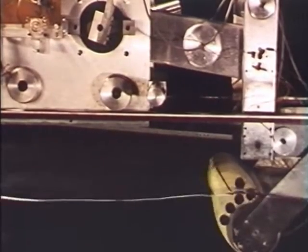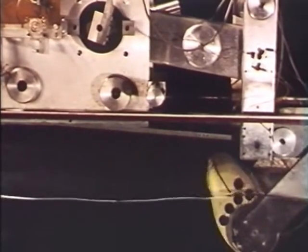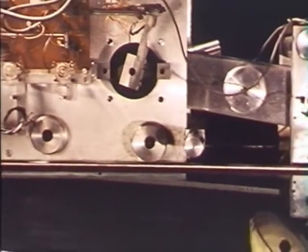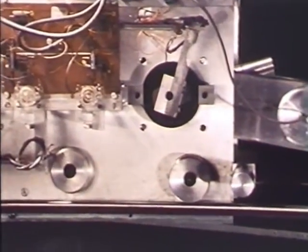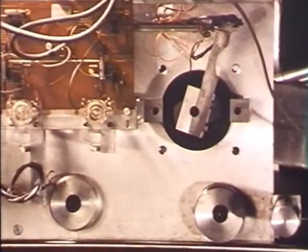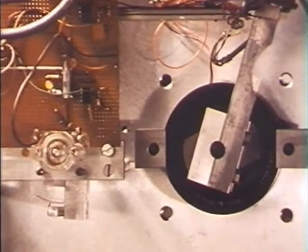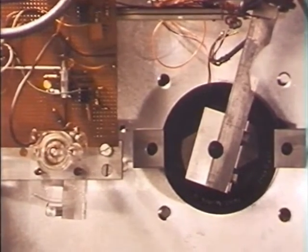There's a view from behind. You can see, nearly at the top of the picture, one of the torque motors coming into the middle of the picture, which is used for controlling the stiffness electronically. It's a powerful bar magnet in the middle of a toroidal coil. To the left you can see a micro-ammeter movement which is used for velocity sensing.